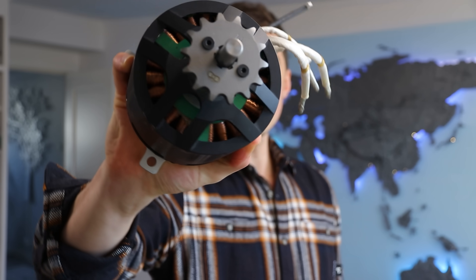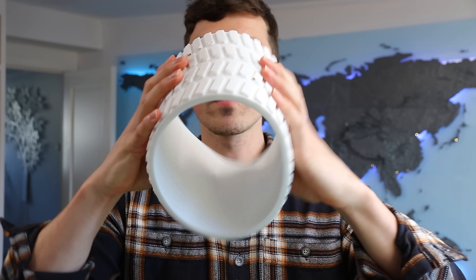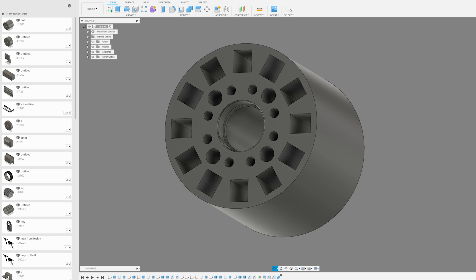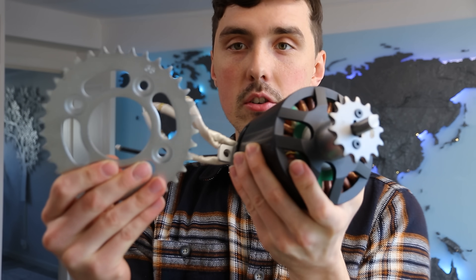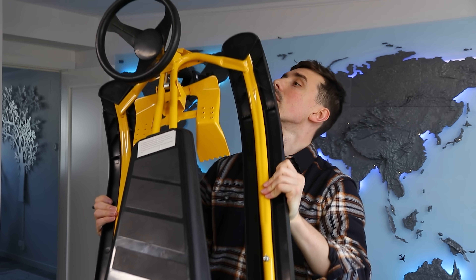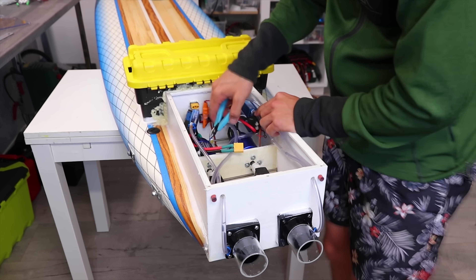This time we're taking the big brushless motor, and what I've done is blown up my last project and made it bigger. There's a TPR tire which is flexible and goes over the hub, a chain drive with gears on the motor, an overkill axle going through everything, and bearings — I believe these are called end bearings. For the construction I have aluminium profiles in different sizes.